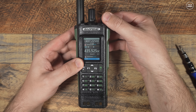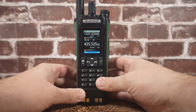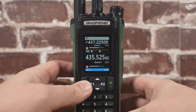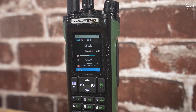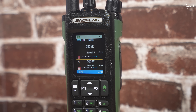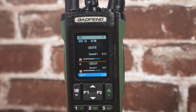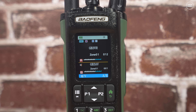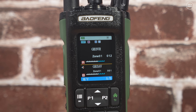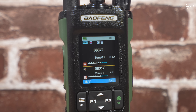Turning the radio on, you're presented with the official Baofeng startup logo, and then it quickly boots into radio mode with two VFOs, although it does not support full duplex, which is a shame. You can turn on dual watch within the menu, but again it only receives one at a time. On the screen you'll notice the word 'Zone 1' under the frequency — the UV32 can have up to 10 banks of memories, which they call zones.